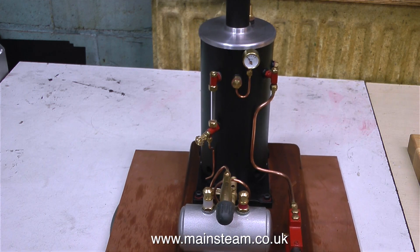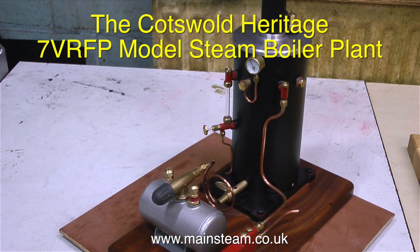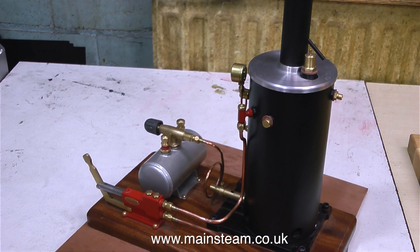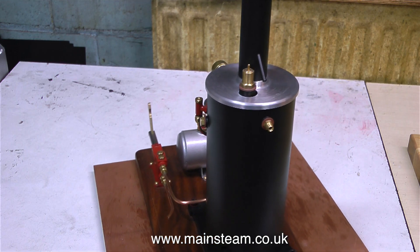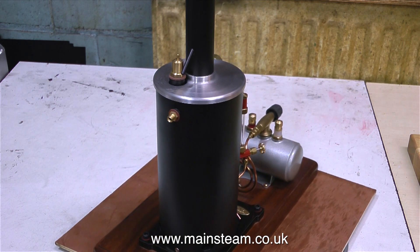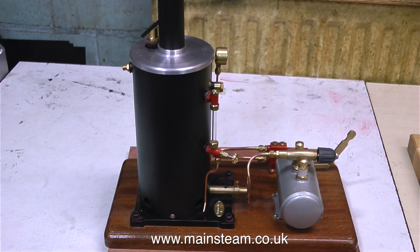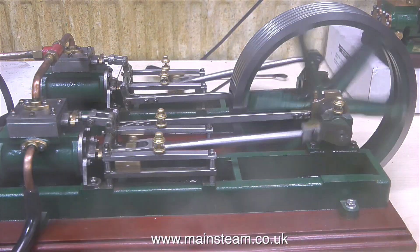From what you've just seen, what are my conclusions regarding this boiler — the Cotswold Heritage 7VRFP model steam boiler plant? It's a very simple boiler plant, very easy to manage, very well made — I'm very impressed with the engineering quality. I don't like the aluminium top cap; I would prefer brass, but that's a personal thing. I love the pump — I think it's a really nice piece of kit. Unfortunately I can't really comment on the gas tank because I don't have the adapter to fill it. It's of course not designed for anything remotely resembling a Stuart Twin Victoria. So we're going to try using two of these linked together, which should produce enough steam to run the Twin Victoria and the steam pump. Thanks for watching and I hope you found it useful.